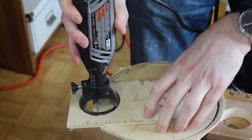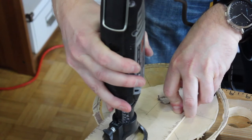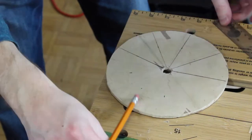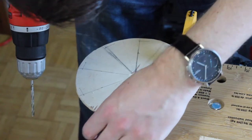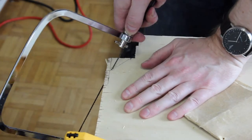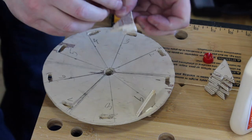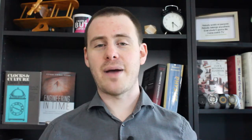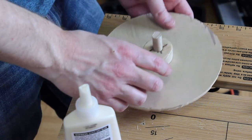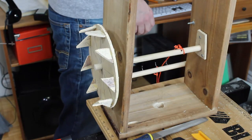To build a crown wheel, I cut a circle out of a quarter-inch piece of board. Since cutting circles is so difficult, I created a jig for my Dremel that rotated around a nail in the middle of the board. Once I had the circle, I measured out 40-degree increments and, using a combination of my Dremel and my drill, created little slots for the teeth to fit into. I then cut out the teeth using a coping saw, with a little tab at the bottom to insert into the slot and glue into place. On the back of the crown wheel, I glued a collet — which is what you call it when you use something like this to attach something to a shaft — allowing me to attach it to the shaft of our power source.